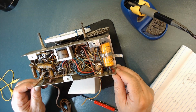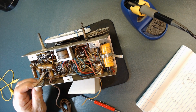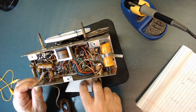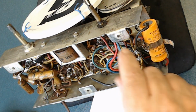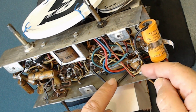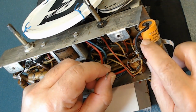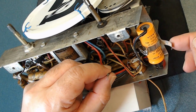If you're doing this as a hobby or you're new, you want to take tons of documentation because it's so hard to keep up, especially if you're not familiar with reading a schematic. Alright, let's unsolder this. Alright, all the wires are out. They run it under this. I'm going to be very careful not to damage this when I remove it. I already unsoldered here too, because this was soldered to the old metal.